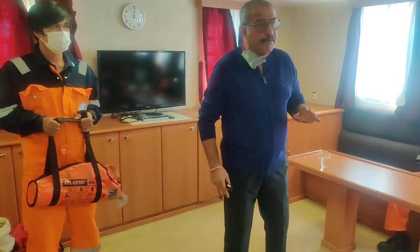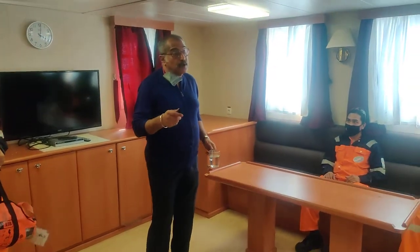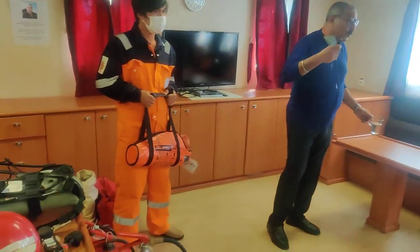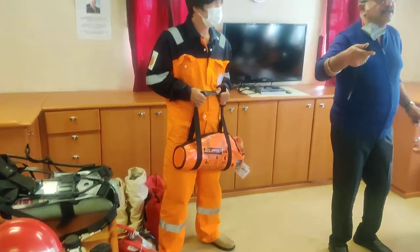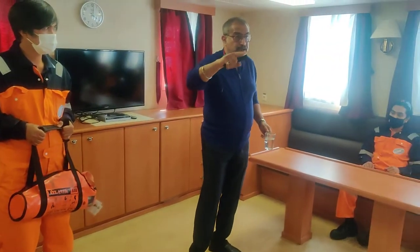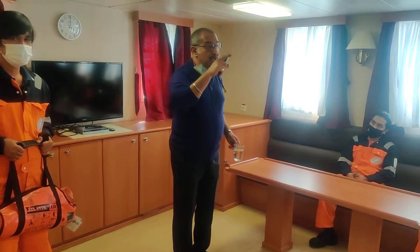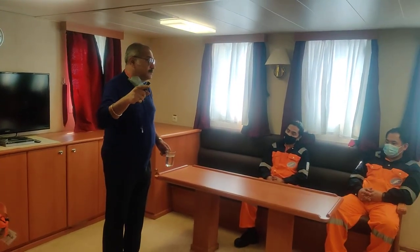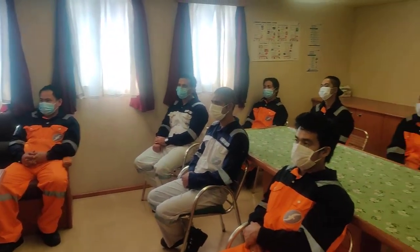IMO has changed the name, only so as not to have confusion. What had happened in the past was that people used to go down to carry out a rescue because they thought it was an emergency life saving appliance. That is the reason the nomenclature has been changed to EEBD, which means emergency escape breathing device. So, no confusion. And when do we use this EEBD?